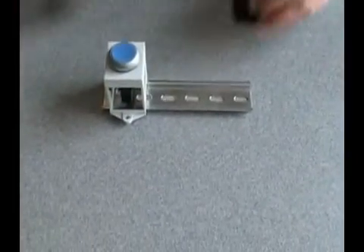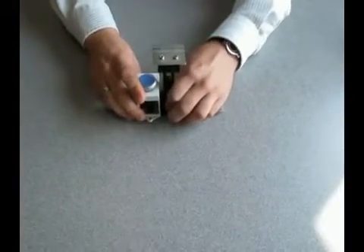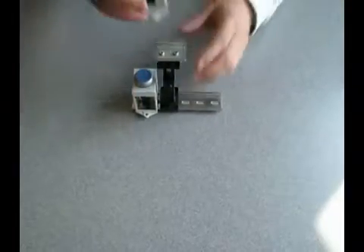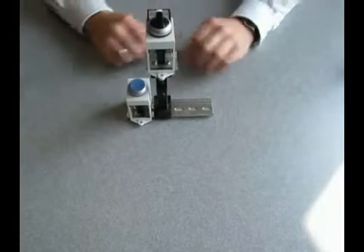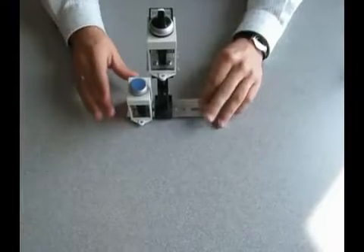The next piece is an extension clip for that. It allows you to elevate a DIN rail attachment a couple inches off the bottom of your panel and then mount your operator directly to the top of that. It's commonly used to mount an operator directly across from the device that's controlling it, like a contactor.